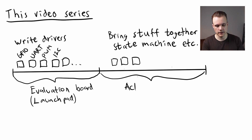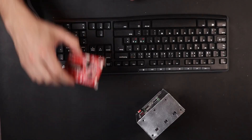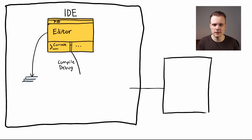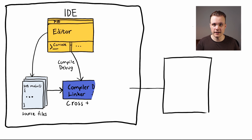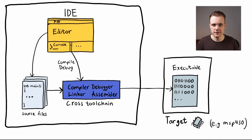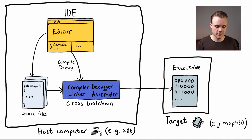So even though I could start programming the robot straight away, in the coming videos I'm going to get started with the launchpad and write most of the driver code using it before moving on to the actual PCB. I also hope this will make these videos more general and easier to follow along. How do I set up my computer to write bare metal C code, compile it, and load it onto the microcontroller? The experience is not so different from compiling a regular C program, except the compiled output runs on a microcontroller with a different processor architecture than our host computer. This means you need a special cross toolchain, including a cross compiler. Going the IDE path, you don't need to care about these details since the IDE comes with the toolchain out of the box — I'll cover that more in the next video.